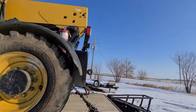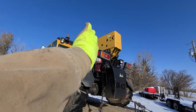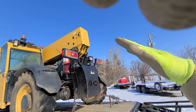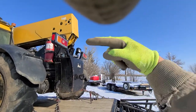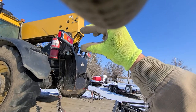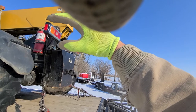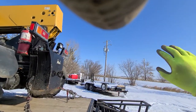This is going to be a nightmare getting it back together, especially if that carriage on the back of the ram doesn't come out. You bring the ram out as flat as you can, then drop it down — that allows the front to come up and over that bogey wheel. You're really going to fight with that. You'll also fight getting the rod on top, and the chain goes around the front and then to the back where there's a block on the carriage assembly. The chain goes back around, and to separate it, there's a pin in the block on the back that allows part of the chain to flop back while the rest goes all the way through as you pull the rod out.